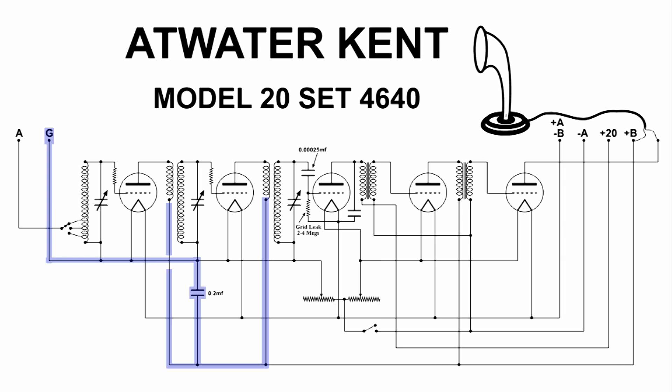What I'm showing here is the return path for the first two stages of this radio. If you take a look at the first two plate coils at the bottom and go all the way down and to the right, you can see that it goes to B+. But the return path for the RF is going through that 0.2 microfarad capacitor to ground. That capacitor isolates the B-plus from ground but allows the RF to pass through it. If that capacitor was open, chances are this radio would not play, even though you had B-plus at both those two plates.